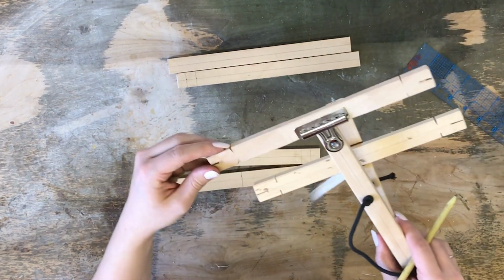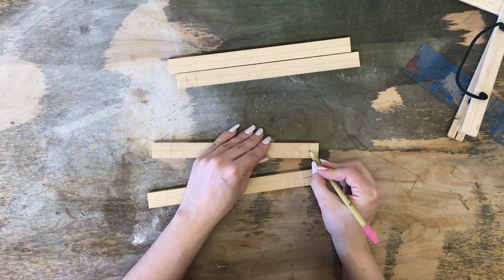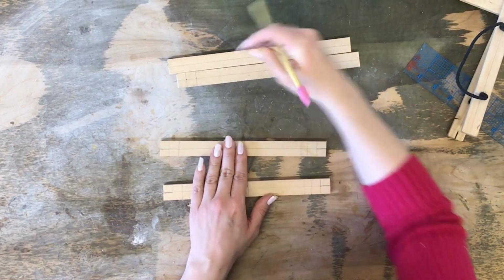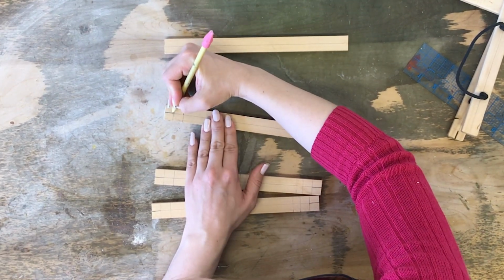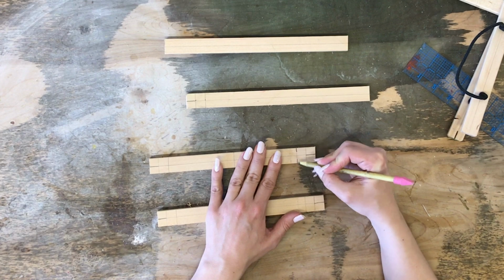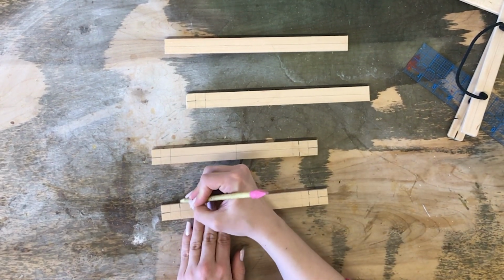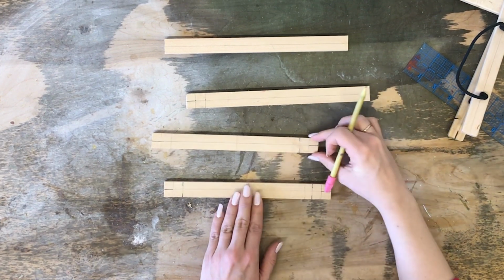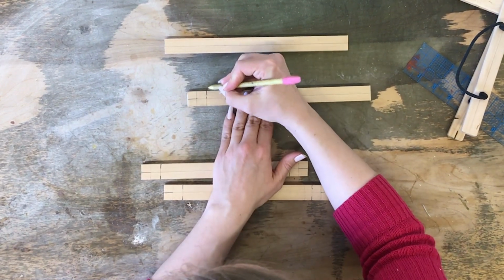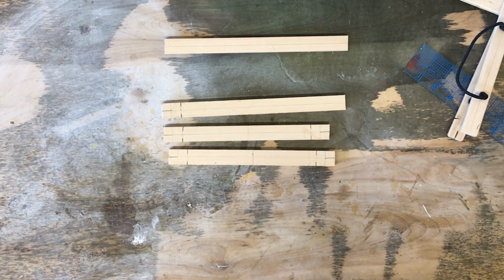And then you're going to cut tiny triangles on the bandsaw. You're going to cut a full notch 1/2 inch up on all of your pieces. And then you're going to cut 1/4 inch on the sides. Be sure not to cut all the way through so that we create our 3-way notch system. And I'm just kind of eyeballing it here. And go cut these out on the bandsaw.